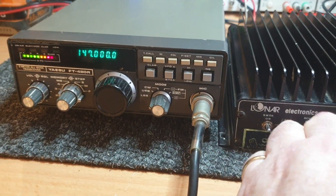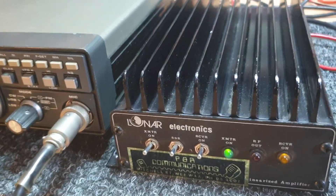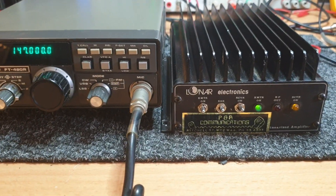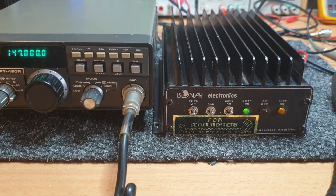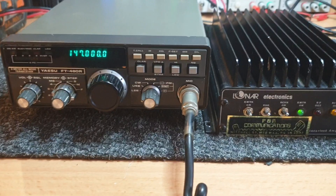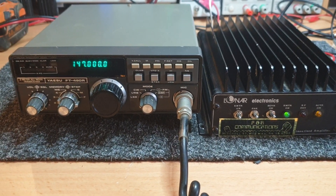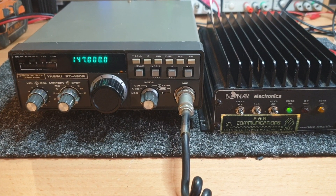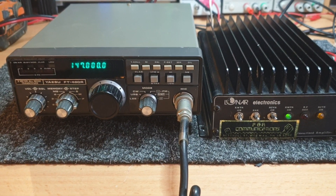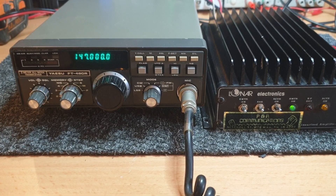There's a lot of gain in that preamp — quite a bit. Let's turn that off. This little amplifier is a nice way to get yourself up to 80 watts on a little 10 watt radio, and effectively with a beam out there you could be a force to be reckoned with. You could certainly do some repeater chasing from all around Australia when tropo and bits and pieces start to happen, and you could be having some fun on 144.1 sideband with a beam to direct around the place.